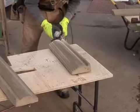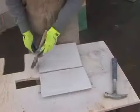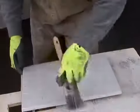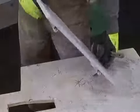When you are grinding, don't take off too much and expose the gravel in the concrete. Whenever you have finished cutting your piece, brush the dust off right away. Dust will cement itself onto the stone tile when it rains, and then it will be quite difficult to remove.